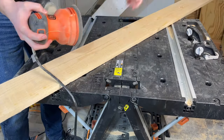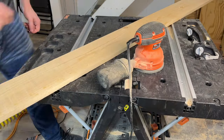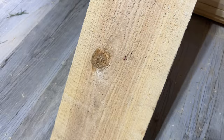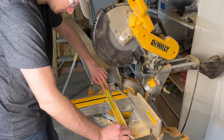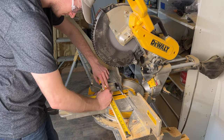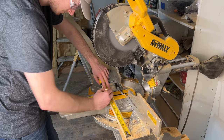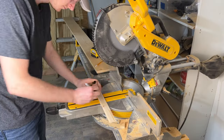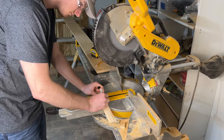There are three key elements to the design that make these fast. The first key is in board preparation — sanding can end up taking a long time, so we're building these on the rustic side and foregoing sanding of the boards. Of course, if you have any egregious spots or strange marks in your pickets, feel free to do some spot treatment. The second key to making these planters quickly is making the cut list as simple as possible. To do this, I've set most of the critical dimensions of the build to 14 inches. Since I'll be using this measurement so much, I'm going to make a 14-inch long stick so I don't have to keep measuring with a tape measure.